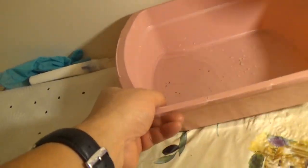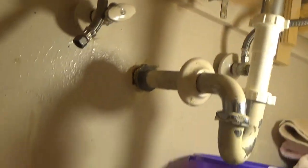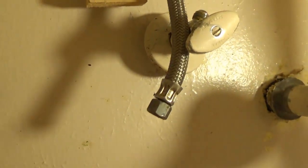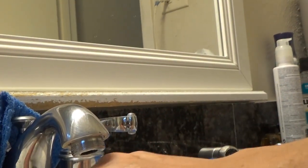I'm going to show you the sediment that came out. You can back flush — so you have it like this, and look underneath. That's the hot, and the other side is the cold. But they do connect. They go like this. So when you have this open, nothing comes out because I shut off the water. But if you turn on the cold with this open, it will go on here and then back flush this side.